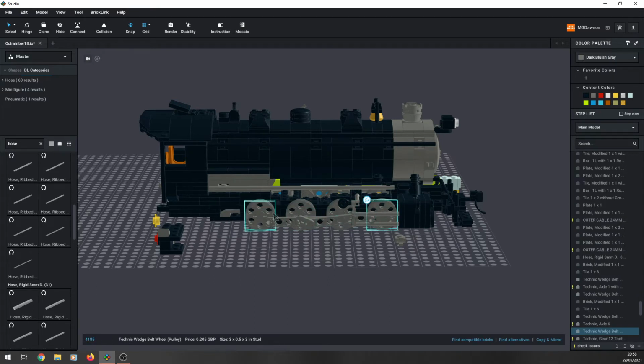So obviously there was a lot of gearing going through. It's a mechanism that would work. To my mind, it isn't, however, a very good solution. It's based off a design I saw on a brass loco, so it has a basis in reality for working in terms of modelling, but it's not the best in terms of performance. You'd lose a lot of power in the transmission, and that's something I don't really want. I want it to be functional more than anything else.